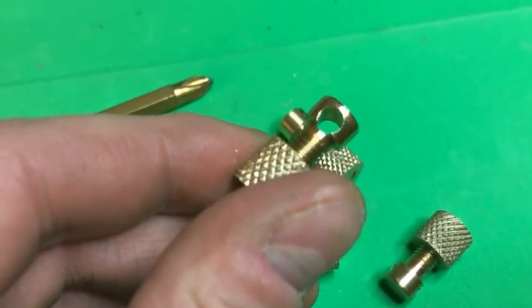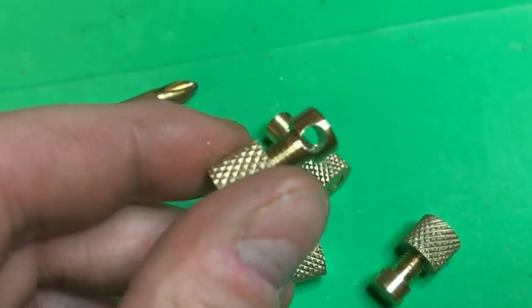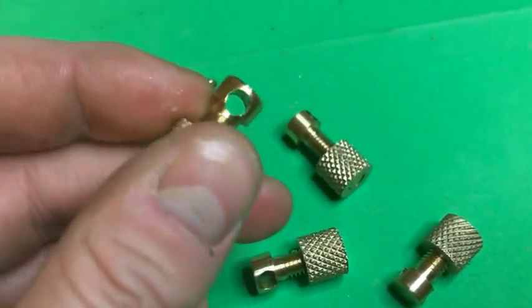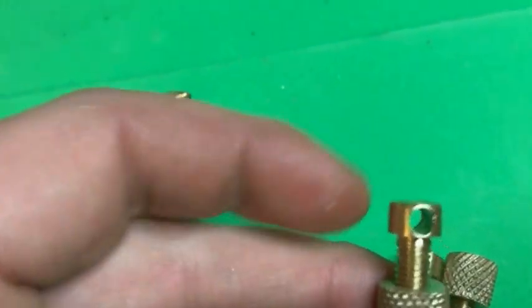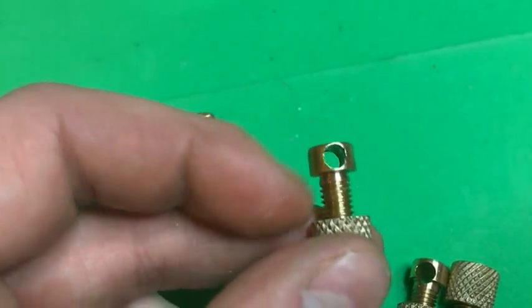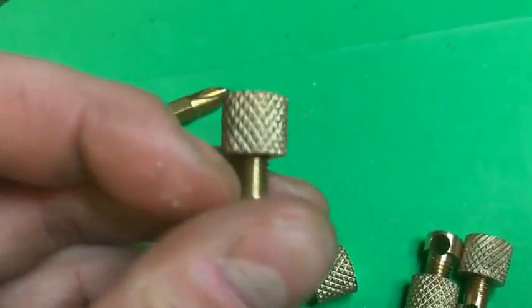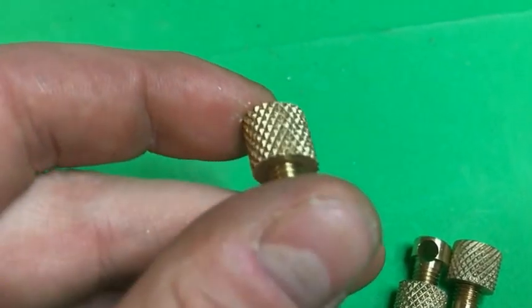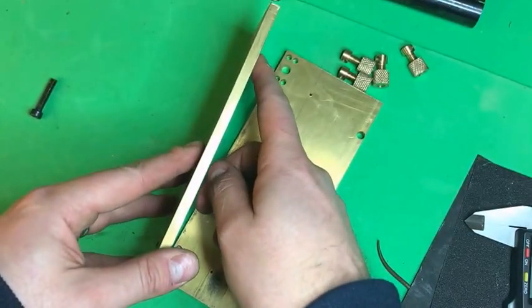As you can see there, the hole is pretty low down on that shoulder. I thought I needed it low down so that this could be pulled right into the bearings, but actually that isn't true. I can have a nice little bit of a gap — more than that really. But anyway, these will do the job. I'm pretty pleased with my knurling — I've not done much knurling before. I find these really useful; this is a clock making tip.